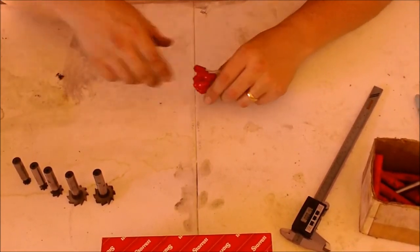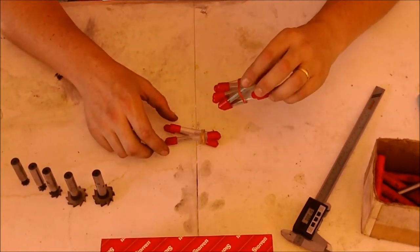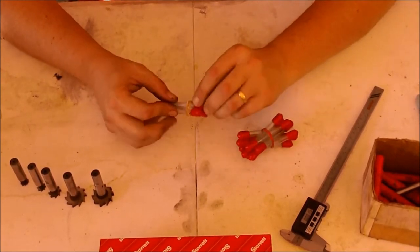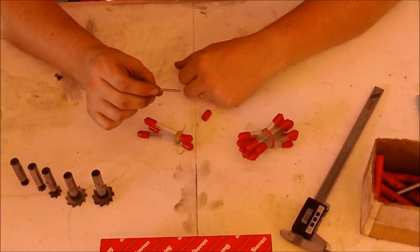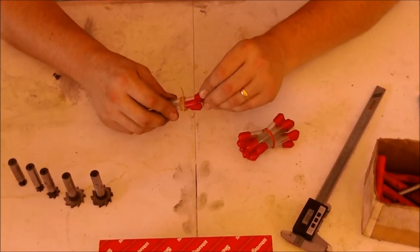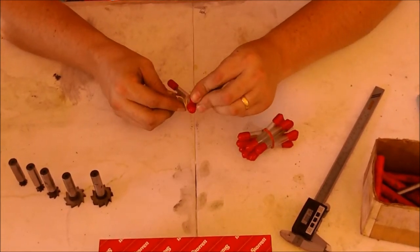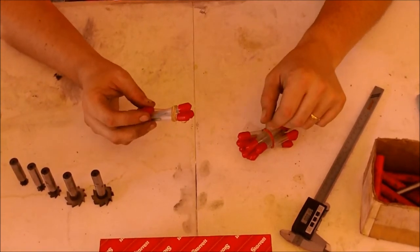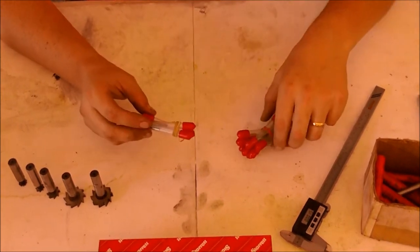And then I also wanted to show you guys, these are the end mills that I use most frequently, my little itty bitty break-easies, as Adam Booth calls them. And these are carbide end mills. They're the 1/8 ball 4-flute end mills, and these I got from somebody on eBay who had a company. I cannot recall it off the top of my head right now, but I had ordered these 3 to try them out and see how they worked, and they worked really, really well. They cut very cleanly, very smoothly.